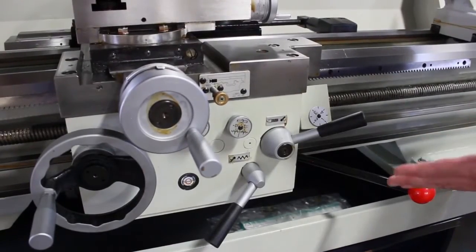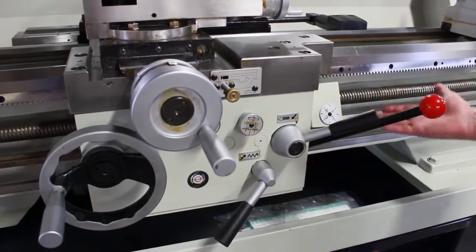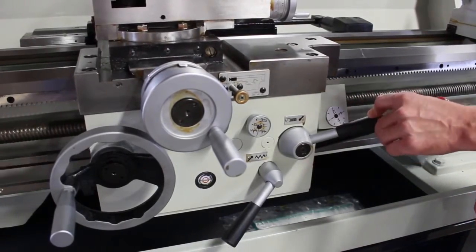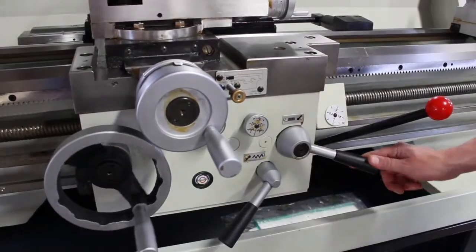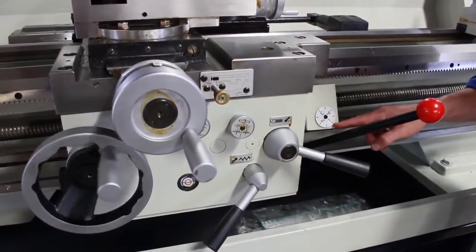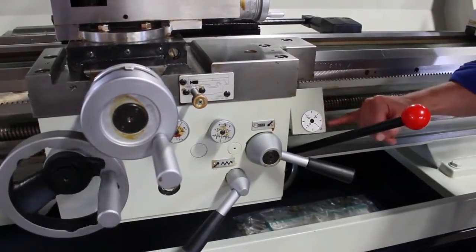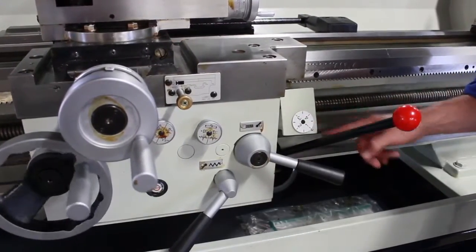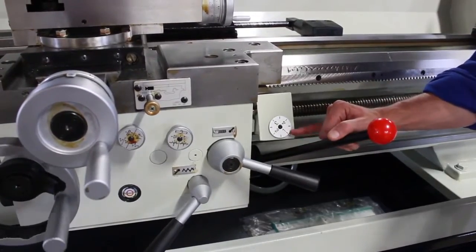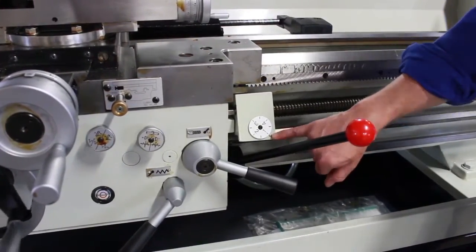We will now demonstrate how to engage the half nut to cut a thread of whatever is desired. We will start by engaging the spindle. As you can see, the lead screw and feed shaft are rotating, as well as the indicator dial for your thread pitches. If we want to cut even threads, we will simply engage the half nut. If you came off and want to re-engage, you simply engage on any of the provided marks — whether it be a one, a hash mark, or any of the numbers. If we're cutting odd threads, you can engage it, but you want to engage it on any of the numbers, not the hash marks. If you were doing a fractional thread or a half pitch, you would need to engage it on the exact same number that you put it on originally — for instance, if you put it on a one, you would have to re-engage back on that exact same one. This little dot right here is the mark that indicates the location of where you want to do that.